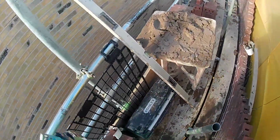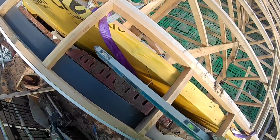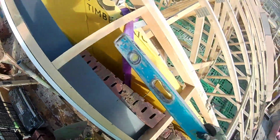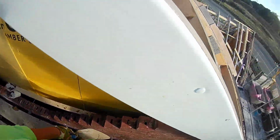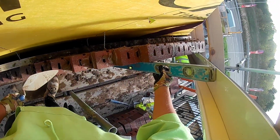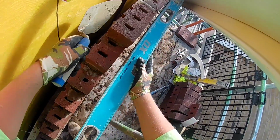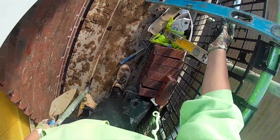You're not going to make a fantastic job in winter of these bricks. You're going to have stuff belly out on you, and that's another thing I'm taking an extra precaution with. I'm plumbing up my gables when I've done, especially near meter boxes, where they're keen now. Basically, on my corners, when I'm taking my profiles off, shove the level up. Meter boxes where that little mini pillar is in the middle, shove the level up. Back reveals, I've been pulling my reveals, which I never used to do. I just used to run it through for a profile, but now I'm going to plumb them up after I've run them in with a profile and check there's no bellying in them.